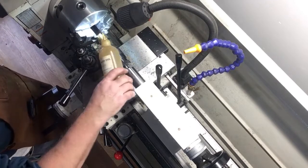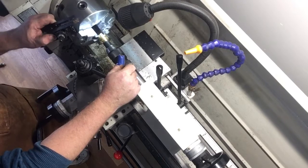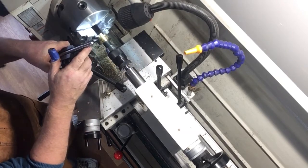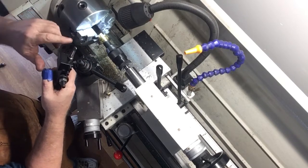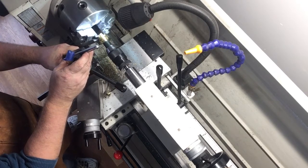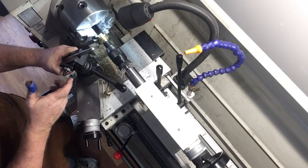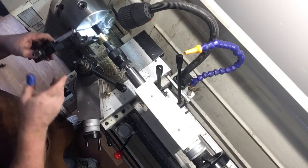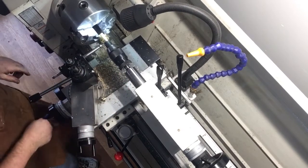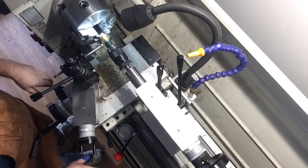That's not bad — I got a little flat spot on it there but that's okay. I'm going to put some oil on this and take the cutting tool out, and put in this tool — this is my burnisher. All this is is a piece of steel that I turned into a ball. I've got two different sizes; this one's ground with a little flat so I can get up to an edge easier for some spinning turnings. You can also do this by taking a steel ball bearing and silver soldering it to a rod.